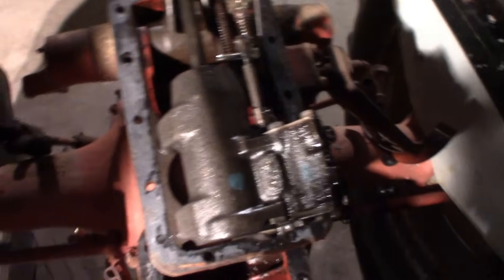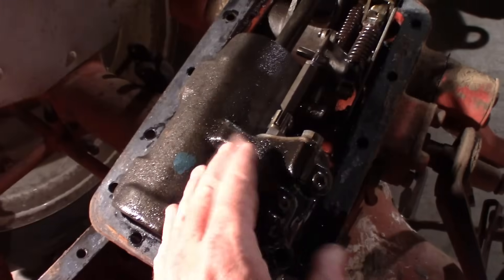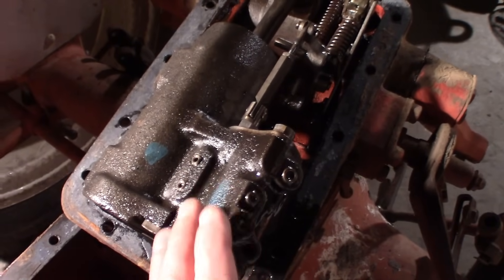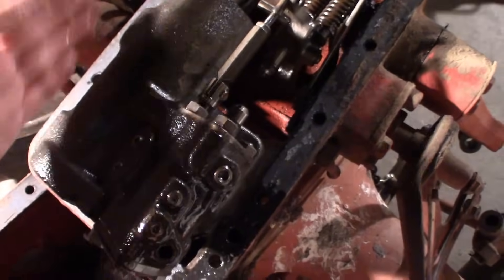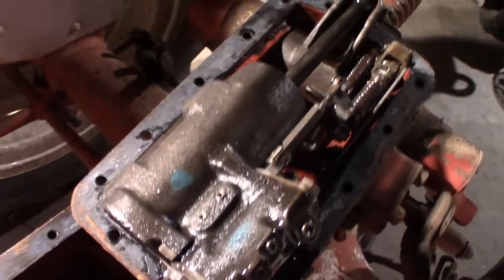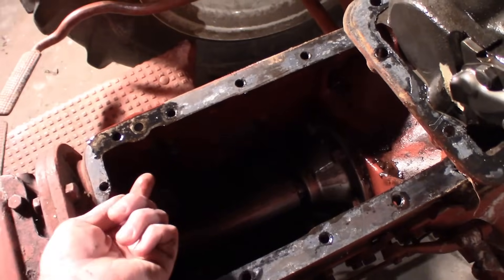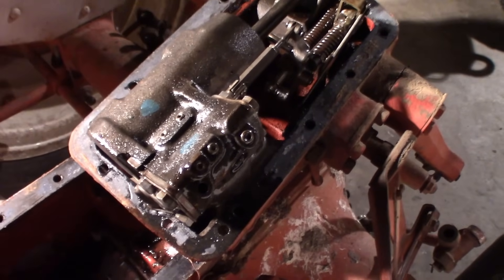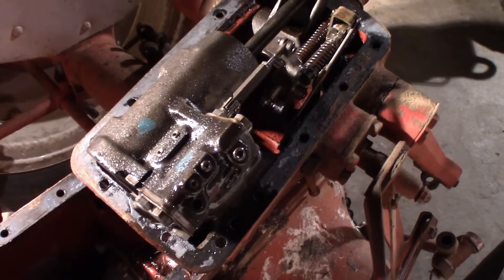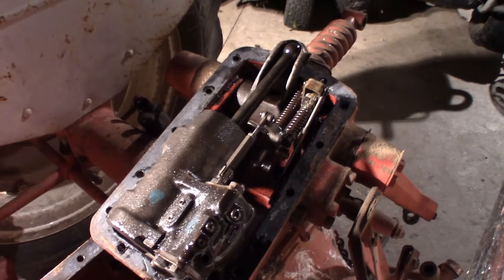On the 2N — doing this at 1 o'clock in the morning after work, so the lighting is not the greatest. The 2N/9N does not have this on it. This is part of the pump down inside the belly of the tractor. All the 9N and 2N have, and I believe the 8N also, is just this cylinder. This side of the cylinder looks the same as this side, just bracketed down. This second hole back here is where your hydraulic fluid comes up through, and there's this hole over here — it goes through the valving and extends this piston. So let me get this apart and kind of get it cleaned up a little bit.